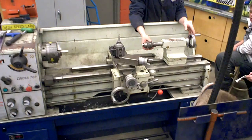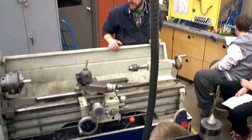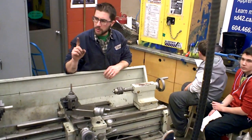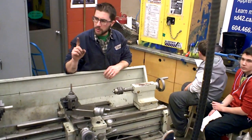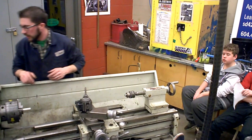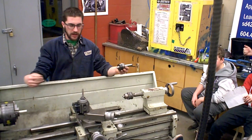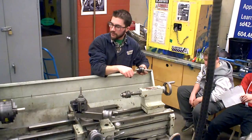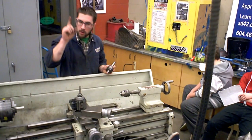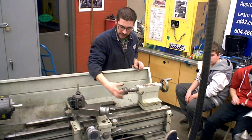This business at the back — this is the tailstock. Headstock's on one side, tailstock's on the other side. The tailstock is an important part of the lathe but for different reasons — it's responsible for two major things. Major thing number one is it steadies long work. Imagine I had a pipe that was like three feet long and I was doing a bunch of machining on it — it's going to wiggle if it's spinning around really fast because there's nothing supporting this end. So you'd use what's called a center drill and drill the end of it out, or you'd have this rest up against the end of it; it has a bearing in it so as it spins around it's almost like hands holding on this side if I'm working on a big long pipe. The second thing it can do is with the Jacob's chuck — just like you'd find on a drill press or a hand drill — we use it to drill holes in our work.